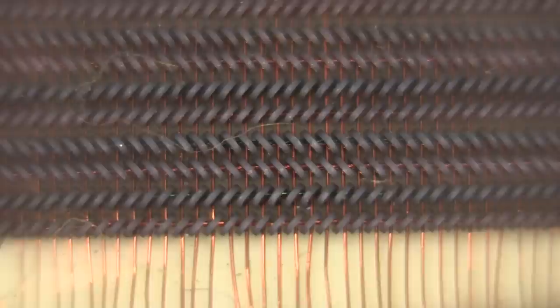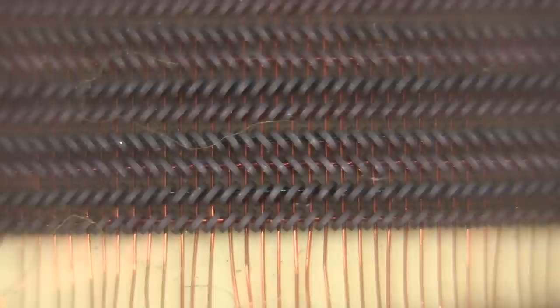Crazy. But of course, you're not going to get any interaction between the ferrite cores because it's the wire actually running through it, and the fact that it's a ferrite ring and the magnetics of how that works, you don't actually get any interference from the ferrites next to it. So it works a treat. As long as you've got the wires actually physically going through them, you can pretty much pack them as dense as you want there.